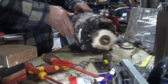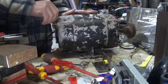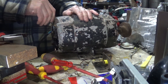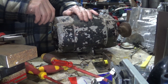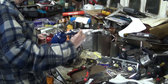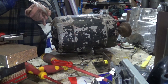This thing was absolutely full of dust when I bought it — wood dust — so I blew all the dust out. Just look at that — it's a thing of beauty. This is filled with Esso Nuto 32. Just put a couple of squirts of that in there.